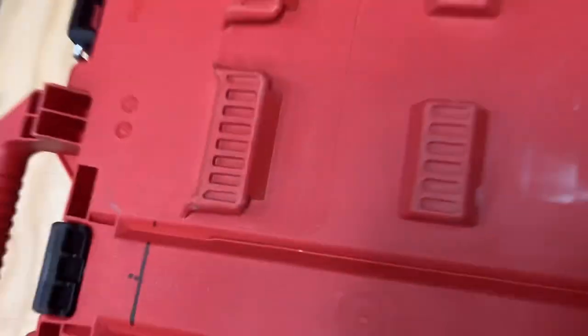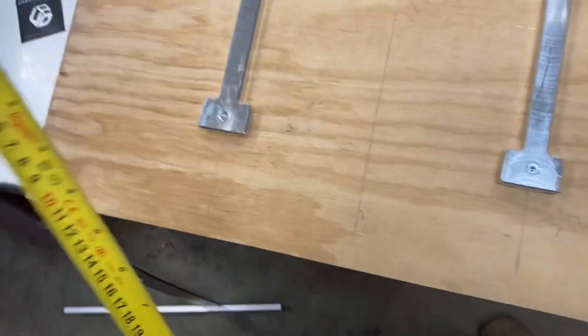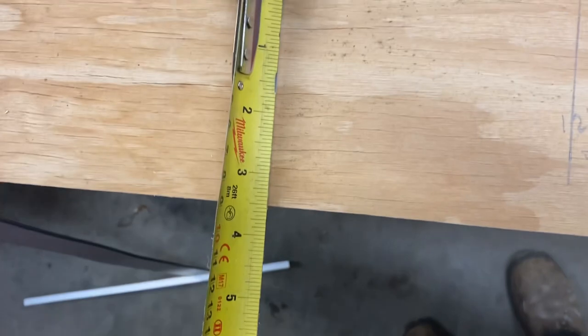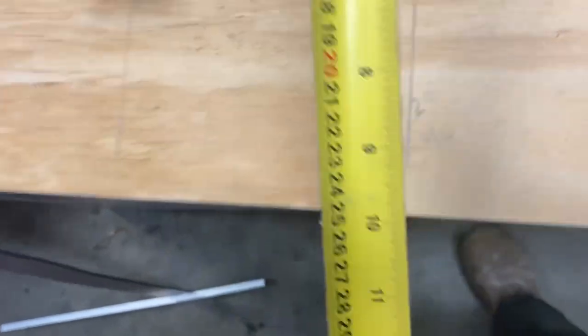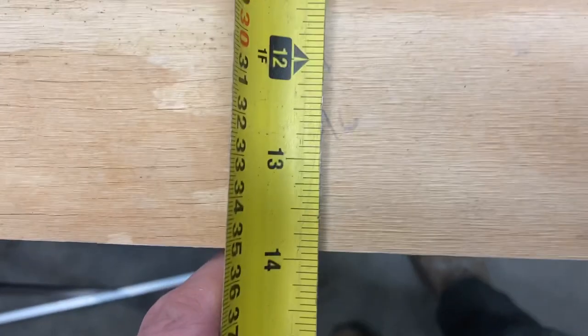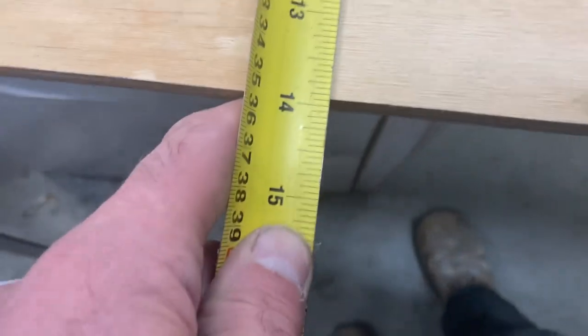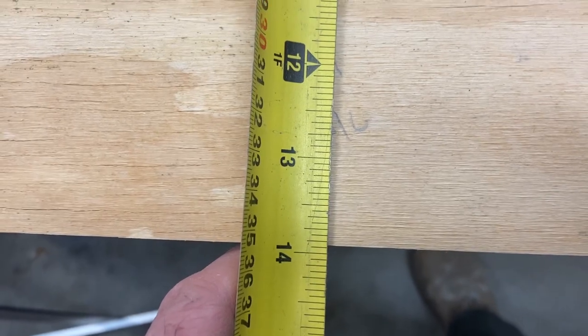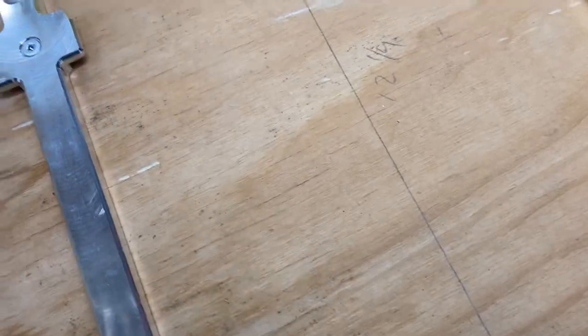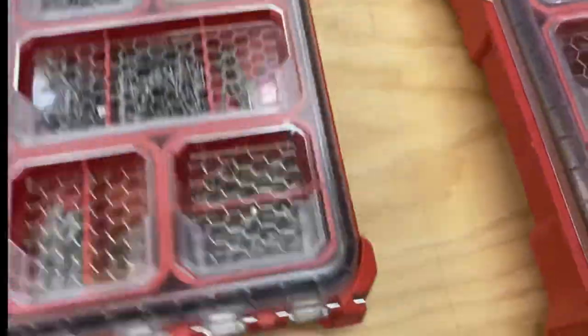In my case, off the bottom edge of the board, I'm three and a half inches to the bottom of that cleat — or that boot, whatever you call it — so three and a half inches for the sides, and thirteen and seven-eighths inches roughly for the latch from the reference edge to the bottom of the latch. You would just adjust that according to whatever you have for your bottom measurements. Mine happens to be three and a half inches, ten inches across on center, and of course the latch is on center.